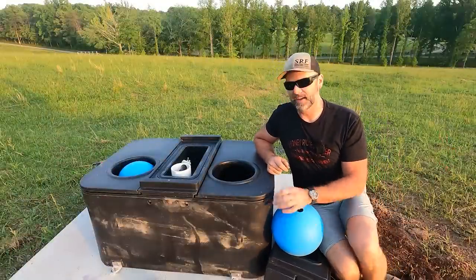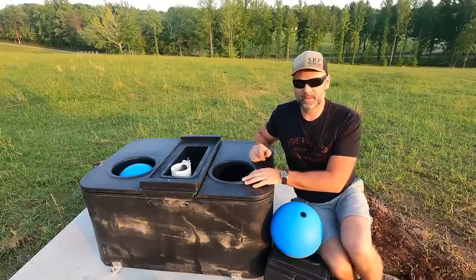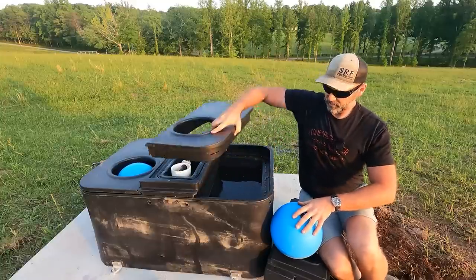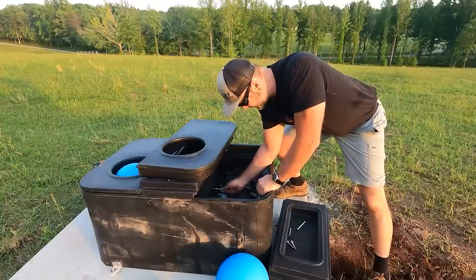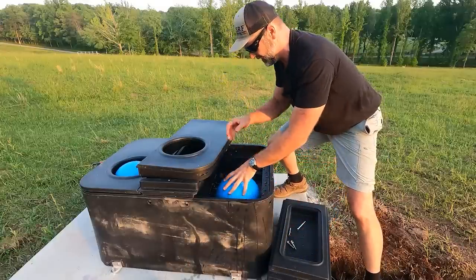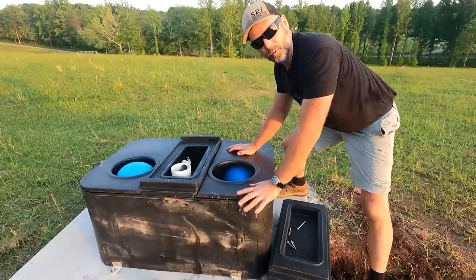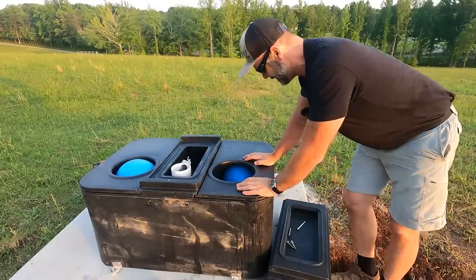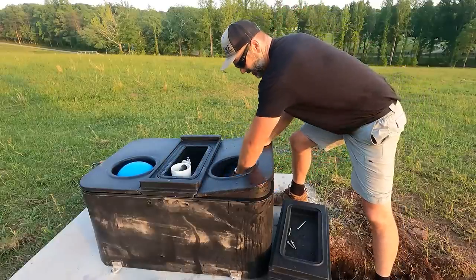Now it's time I talk a little bit of animal psychology. Do cows instinctively know to push a blue ball down? No, they don't — you've got to train your cows to this. What I've been doing is having one side set up with the blue ball in place and the other side held down by these longer training bolts. Simply put this half-inch training bolt into the threaded hole, push the ball down underneath that bolt, and tighten it down so cows can get their head down in here and drink. If you've got young baby calves you're worried about, you can leave this completely off until your new calves get trained to this water tank setup.